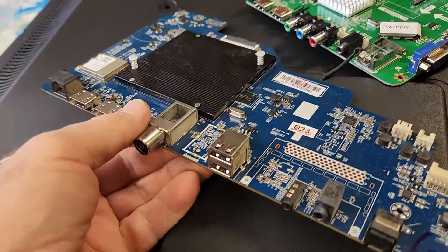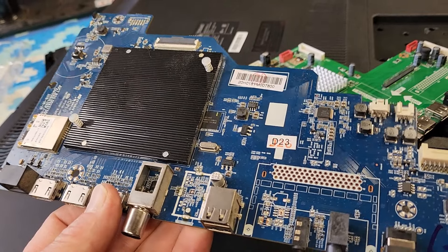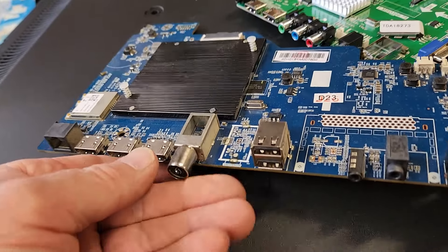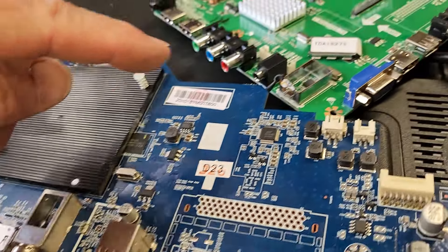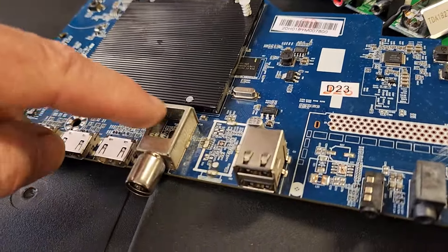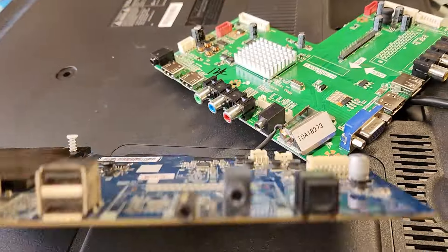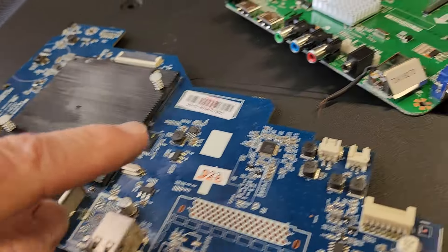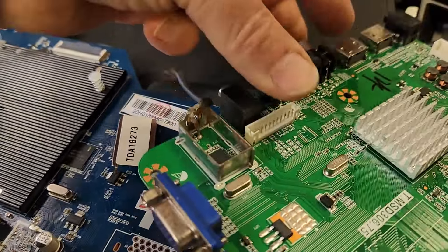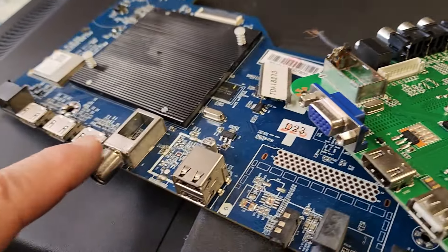I've just delved into my mid-grade circuit board box going for scrap. Some of you may recognise this board — it's from a recent TV repair fail where I tried to bake this main board in an oven. The antenna jack and the little box is identical in size to the broken one. Even though that one had a solid top and this one's got a cutout, I don't think it'll make any difference — the terminal spacings look much the same. It also looks like someone has been in here and tried to clean up a solder joint, and it's gone a little bit rusty.